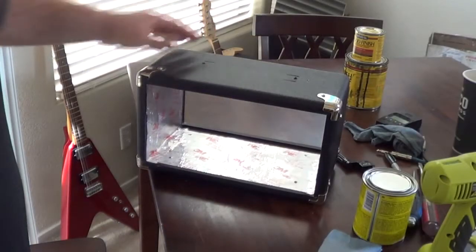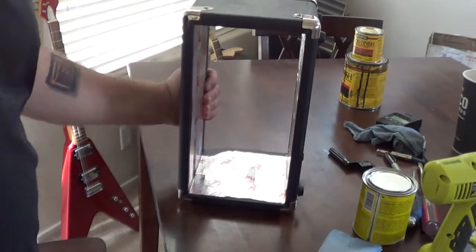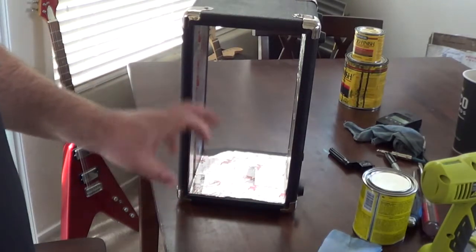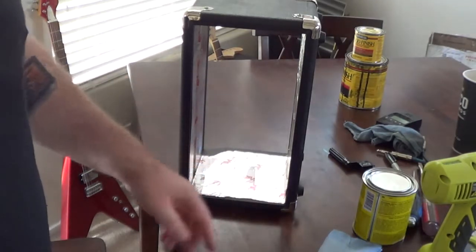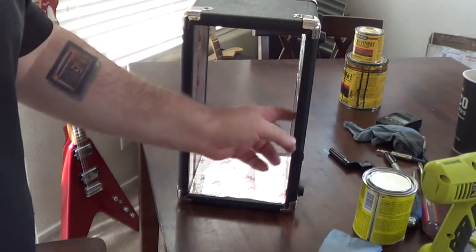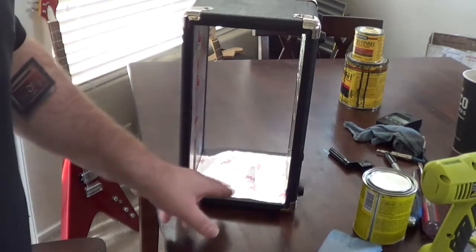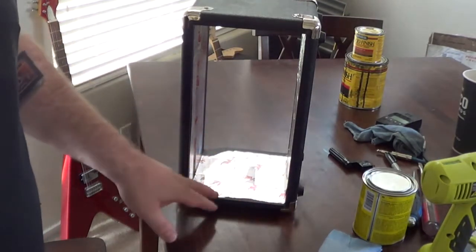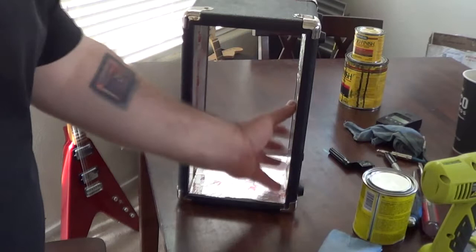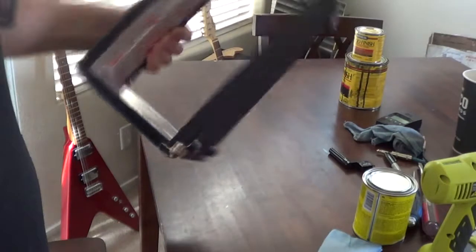Alright, I just wanted to show real quick the cabinet for this thing, while I'm waiting for those parts to get delivered. I've got regular shielding tape that's silver colored and doesn't have any writing on it, but I couldn't find it. But I bought this 3M tape a while ago. I think this is meant for insulation and stuff, to seal insulation, but it will actually hold a current. So when I have everything put back in here, this should provide pretty good RF shielding for the whole thing.